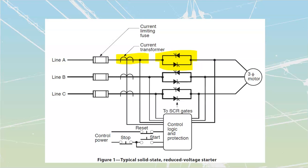Where they get complicated is inside the control section over here, and that's put together by a manufacturer — we're not going to put that together ourselves. All we have to do is run the lines into the actual controls. We're going to have inputs: reset, start, and stop are shown here as a demonstration. We just wire those inputs in to tell the drive when we want this motor to start.